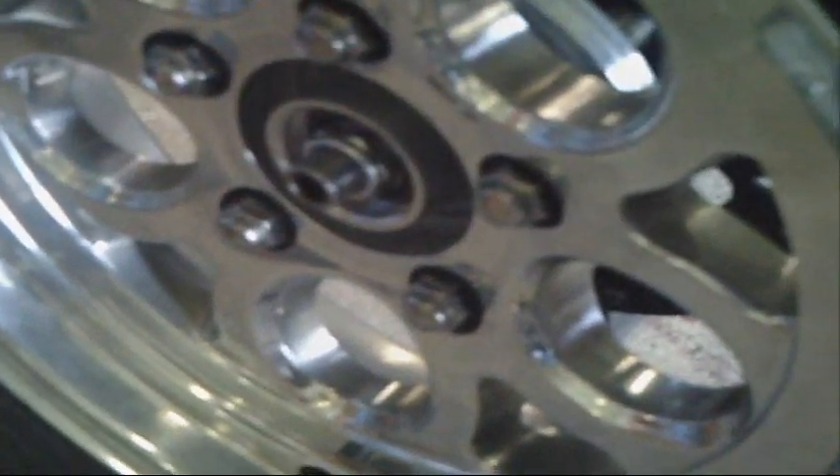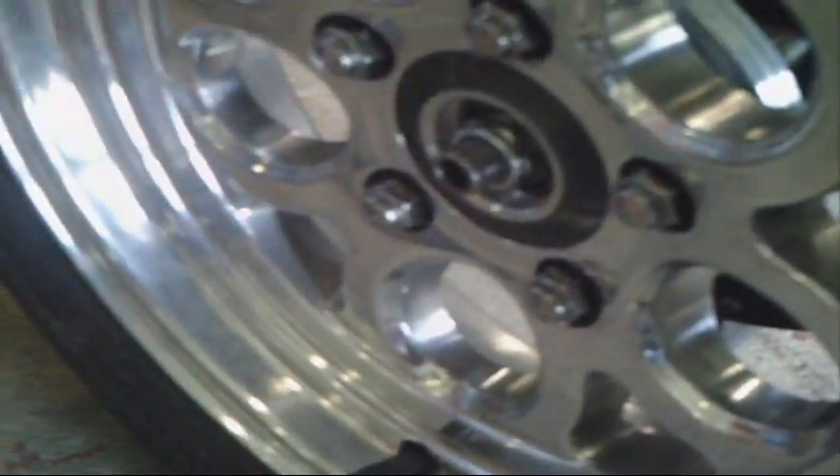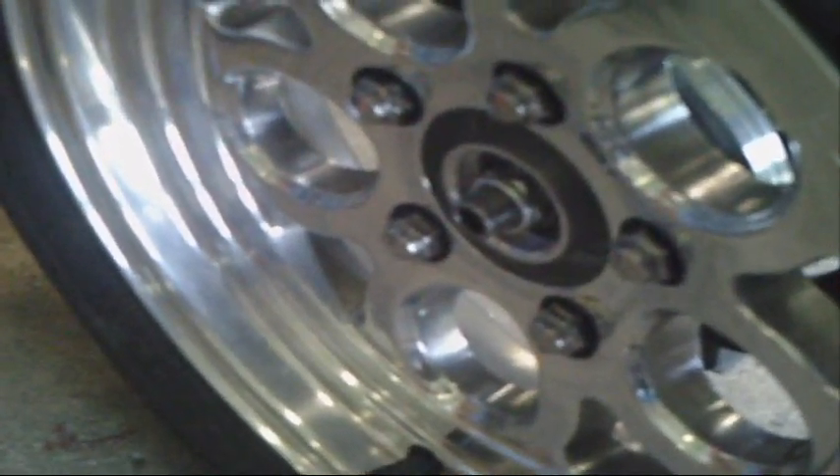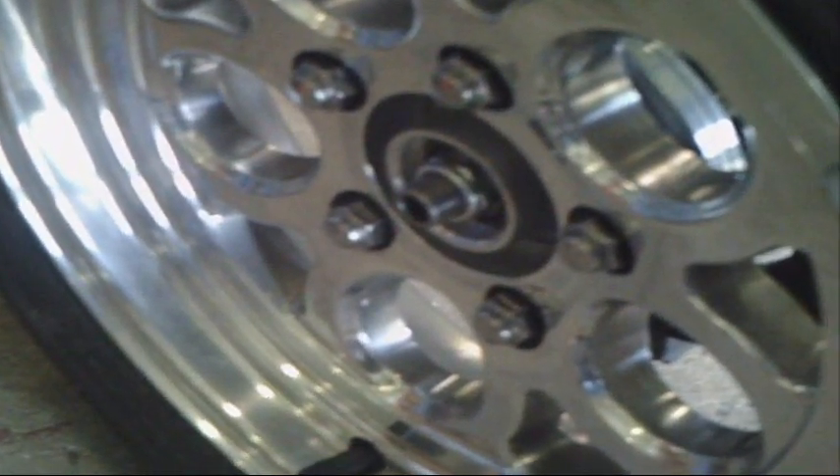These are standard 15-inch wheels with a five-lug, I think it's four-and-a-half-inch centers for your five lug — all your front dragsters use this simple setup here. We can spend more money and get lighter rims to help get rid of some of this extra weight. The rotors we're using would probably handle a 2,500 to 3,000 pound vehicle — they're standard automotive Wilwood brand name rotors — and they're way too much for this vehicle. For the weight of this vehicle we're way over-braked.